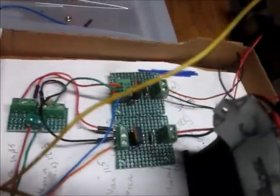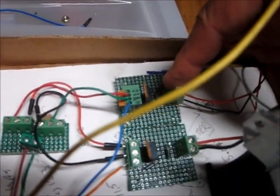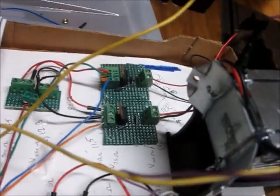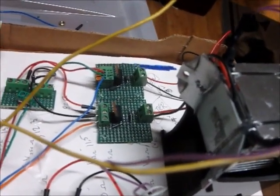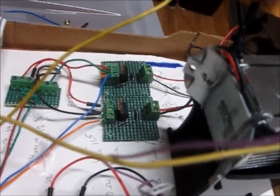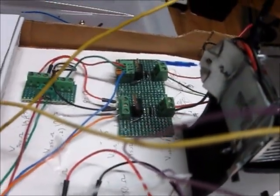Okay. And this is the gate MOSFET. The MOSFET's for the fan and a MOSFET for controlling the peltier module temperature and power. It actually is chopping the volts. It's sitting at a duty cycle, supposed to be giving it 3 volts.